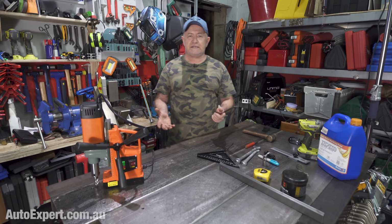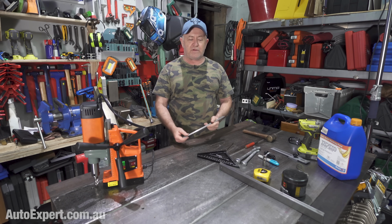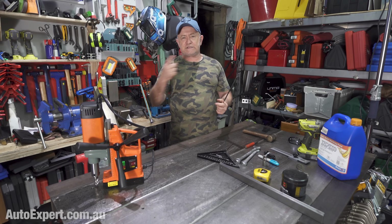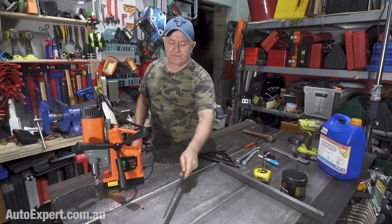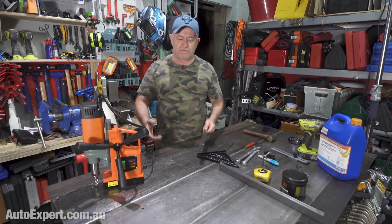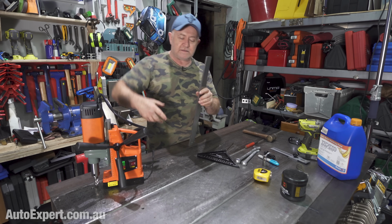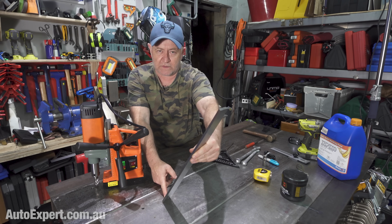This is one of the real advantages of this kind of system. Now, I don't know how this video will go over, but if you're interested in this, I can show you some future upgrades. I've already got the drilled and tapped holes for the bench grinder, which is actually a sanding disc and a wire wheel and a linishing disc. And it can go that way or that way. I've cross-drilled that. I've got the 4 holes for the vise on a swivel base here and here, so I can move that wherever I need. That means I can use the vise as a vertical fixturing surface. I can rotate the jaws around and hold anything in any angle I want.